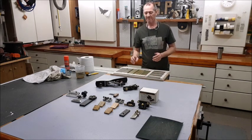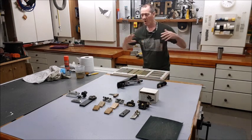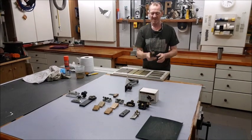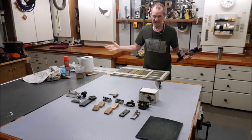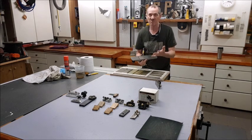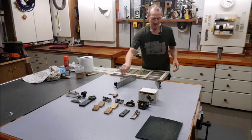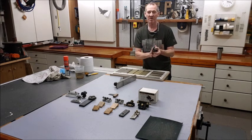In this second part we're going to be doing planes. We have two basic standard planes, and there's a whole range of planes, but we're only going to cover the two basic standards: your bench planes and your block planes, the small block things. The bench planes come in numerous sizes and for numerous jobs. The angles can be set to many different angles depending on what you want that plane to do, but there is a basic, and the basic is what we're going to do. Again with the block plane, it depends on what you want it to do, but again we have a basic.